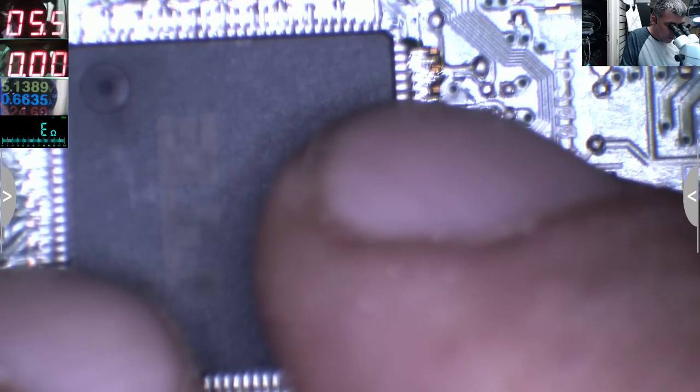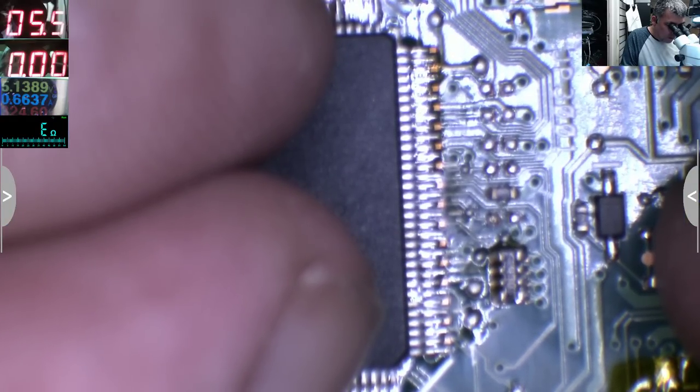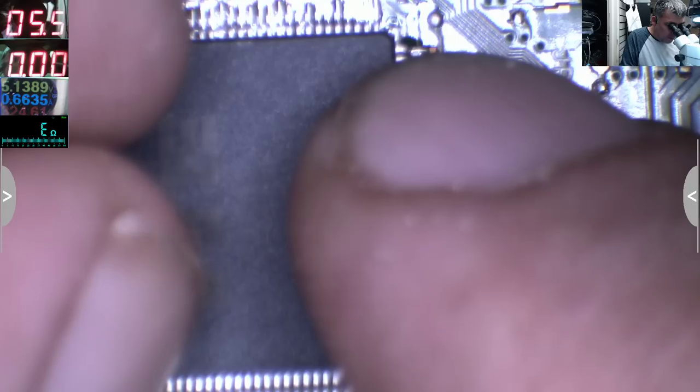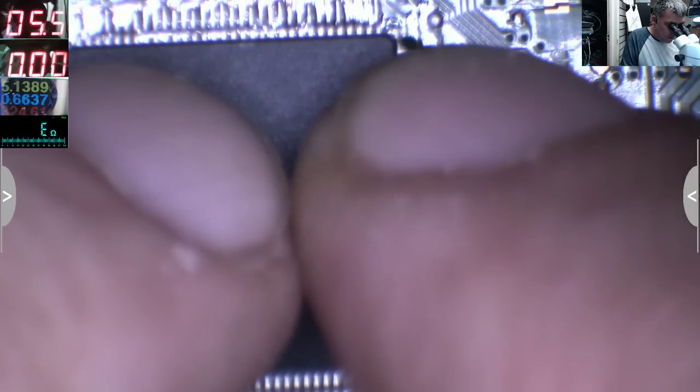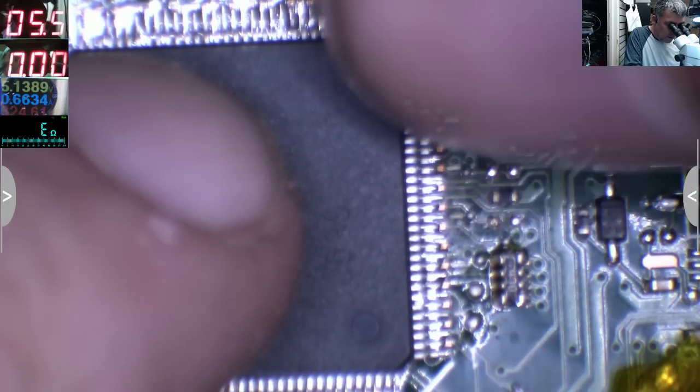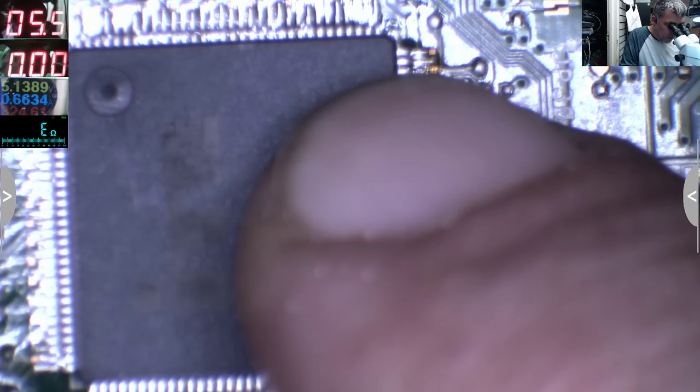So we just need to put this on, each pin to be over the pin from the board. You know what you can do? You can even solder a few pins with a solder iron if you want. That's the hard part. After that, it's easy, yeah? And you'll see what we'll do when we find a position.